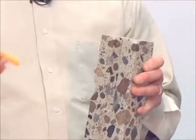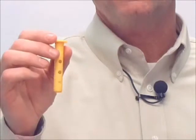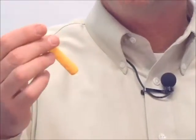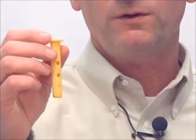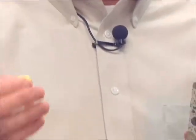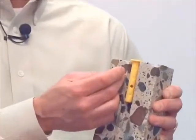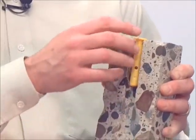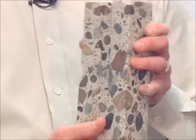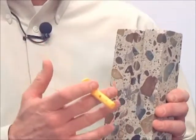With a second sleeve design with different hole cutouts, what I've often seen in the field — even by consulting engineering firms — is that instead of knocking out only one hole at the correct depth, they knock out holes along the full length. Again, you get a watered-down, low average that underestimates relative humidity. Obviously this could lead to the wrong decision of a floor covering or coating being installed. Other sleeve designs have similar problems, and the thicker the slab and the deeper the hole, the more the problem can increase.